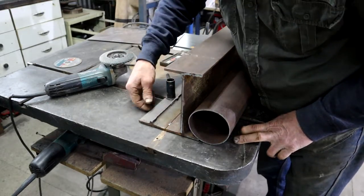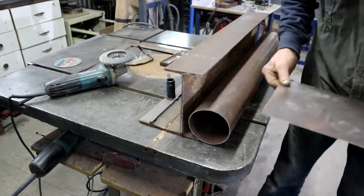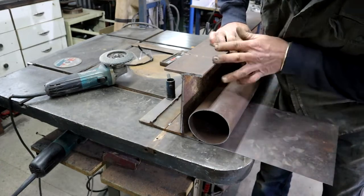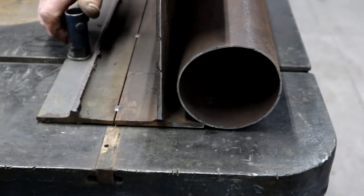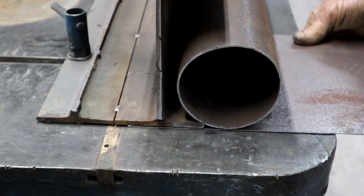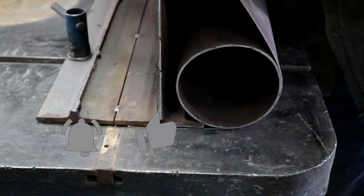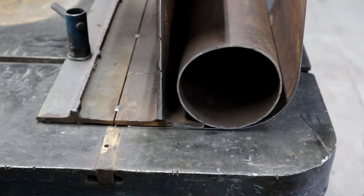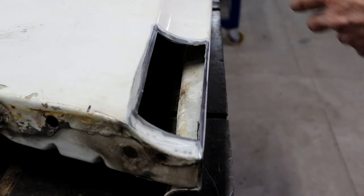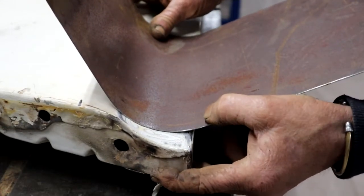Here it's clamped on - that's holding it down exactly where that filler piece is. Now I can slide my work piece in underneath and bend it around the pipe. The contraption is clamped to the bench, my work piece can slide in underneath like that, and now I can bend it around the pipe. Obviously there will be a little bit of spring back, but there's my curvature. Let's see if it'll match - that's pretty darn close if you ask me.